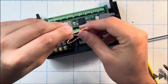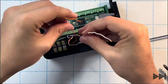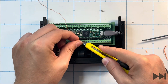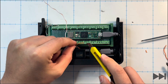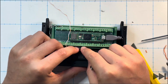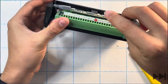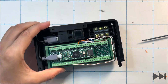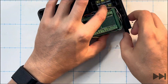The final pair are the orange wires: the short solid orange wire goes to terminal 13, and the longer orange striped wire goes to terminal 12. Due to the fragility and short length of the wire, I use a Stanley knife to cut off the outer sheath instead of wire strippers before fitting it into the terminal. The orange striped wire is then routed around neatly to terminal 12 with a little excess, stripped and fitted into the breakout board.